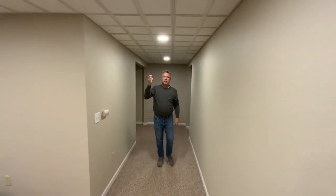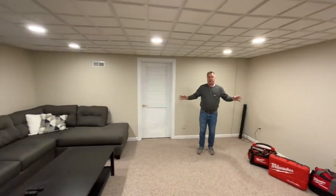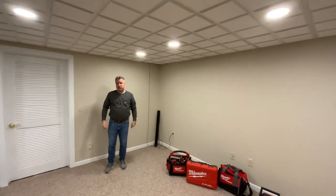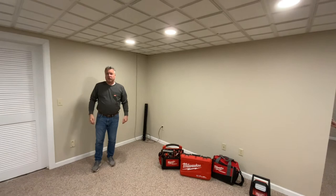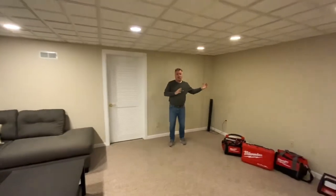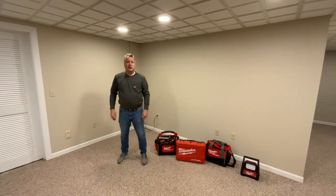We've completed the project. We've installed 12 new LED lights to replace the fluorescent ones. You can see that the light shines really nicely and floods out the whole room — it spreads a lot nicer than the fluorescents, uses less electricity, and you have the option of changing the color temperature. We have these set on 3000 Kelvin, but you can change the intensity, make it cool, make it warm, whatever you want. We've also added dimmer switches so we can bring these down on each side. We've put two zones in here, so if you're watching TV you can have lights off on one side and on over the other. It's a really good solution. If you like what you see here, please subscribe to my channel — it's Handyman Dan, quick and easy do-it-yourself projects.